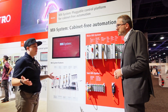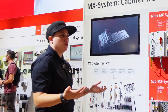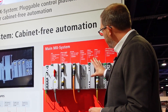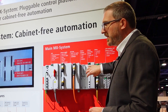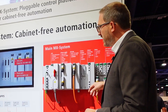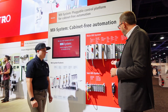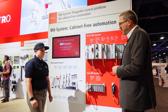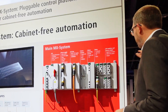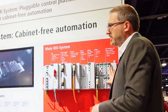So that's pretty much the full solution. What happens if something is not covered — if there's a special component not in your current product line? We don't show it here right now, but there's a module about this size with a cover where you can place any third-party component inside as long as it fits. Inside, you'll have the possibility to plug into the EtherCAT and the 24 and 48-volt power supply. You get access on the bottom if you need something else. So basically you could put any component that fits on the base plate. We also have a big extension unit you can plug at the end, but then it's only IP52.